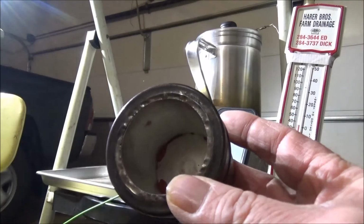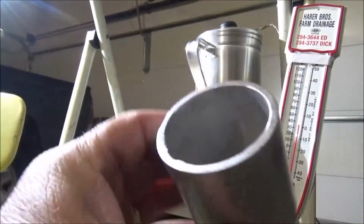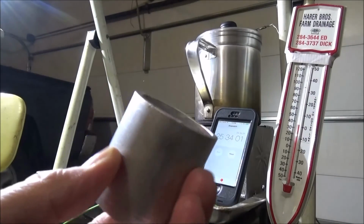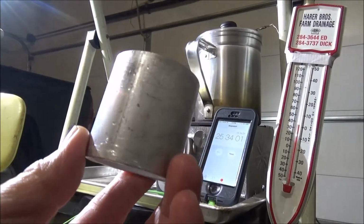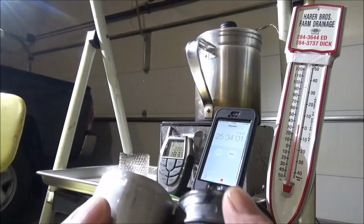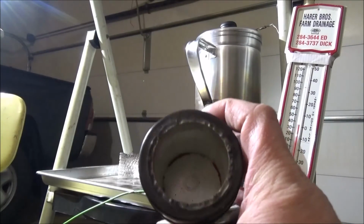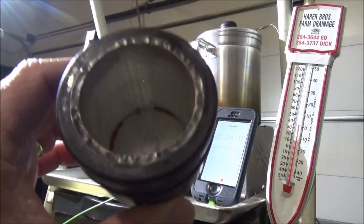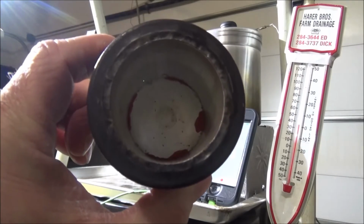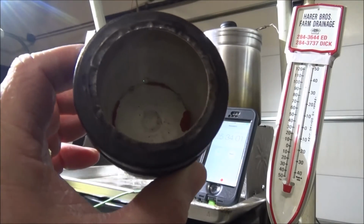It's a Kamenstein. The only thing different with this is for the centerpiece, I used an 1/8 inch thick piece of aluminum pipe. I think I bought 4 foot of it for $1 or $4, then I cut it up into shorter pieces. If you want to do the same thing, cut it the right height so it seals to the top. On this one I put some high temperature silicone sealant around the top and a few dabs in the bottom. Of course, you have to have slits in the bottom so the alcohol can run through the bottom and in between the walls.